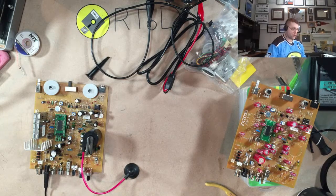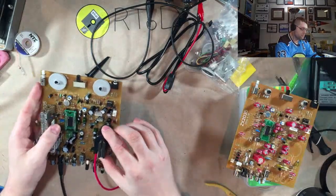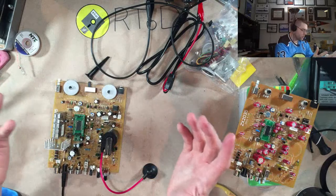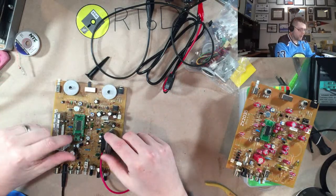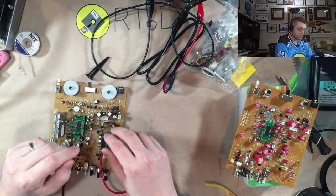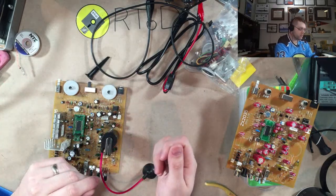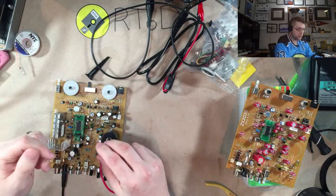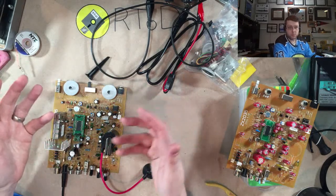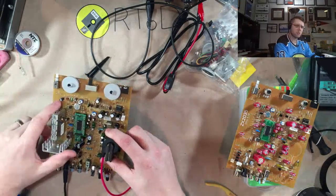There's a video I found on these Chong X capacitors, and I might try to recreate some of it for part two. They would hook it up to a power supply, and let's say it was 10 volts or whatever, and they would supply 10 volts to it. But if you went slightly above or supplied even the rated voltage for a long period of time, it would fail catastrophically. And then he would take a good capacitor, a name that you would know and recognize, and put almost twice the amount of voltage through it, and the capacitor would be fine. So really interesting results, and I'm going to try to recreate some of those for part two.